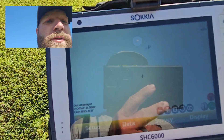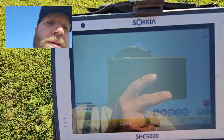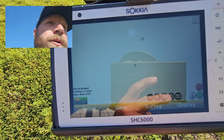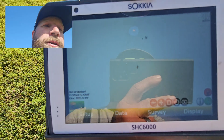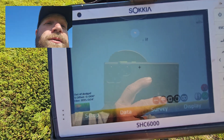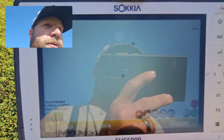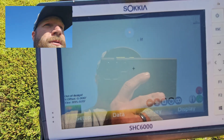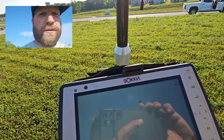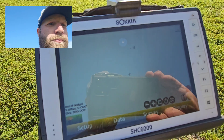Just something worth trying if you're wanting to get some extra battery life. You can do this on the VRs through the internal software, really on any of these - through Pocket PC, through Carlson, a lot of receivers will have a high or low RTK output or base output setting. We don't always know the exact wattage, but it's worth playing with. My opinion - if you're doing a lot of smaller commercial job sites, like 10 acres or so, I don't see any reason to run the one-watt setting. You're just using more battery and generating more heat from the radio. Give that a try, leave a comment if you have questions, and hope that helps - just another quick little tip. You guys have a good one.